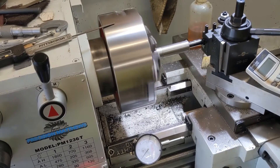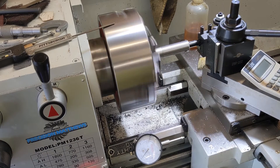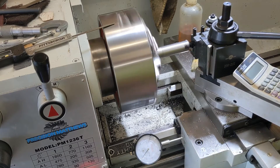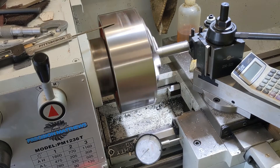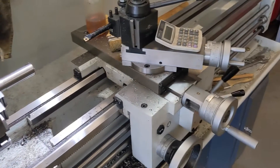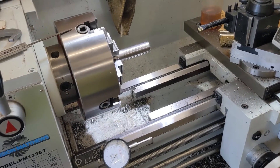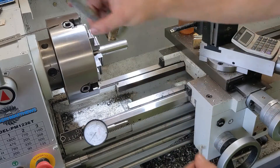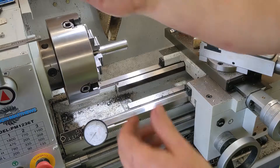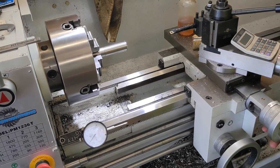We're cutting to 3 inches deep and our internal bore size is going to end up 695. I'm going to cut until this guy goes one revolution and stops at zero. One thing I've learned with this lathe is when you're moving around it, if you've got a belly like I do, don't bump that guy with your belly — it screws up all of your measurements. Okay, there's 675. Let's double check that. This guy said 680. That's why you double check — it's hard to read those guys sometimes.